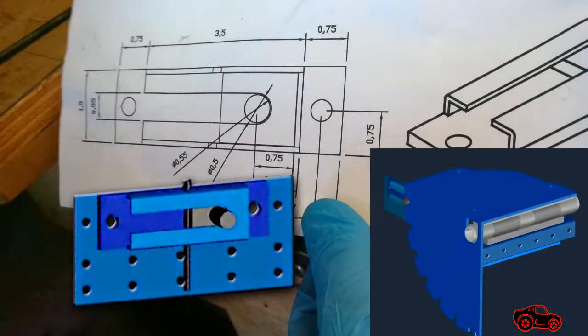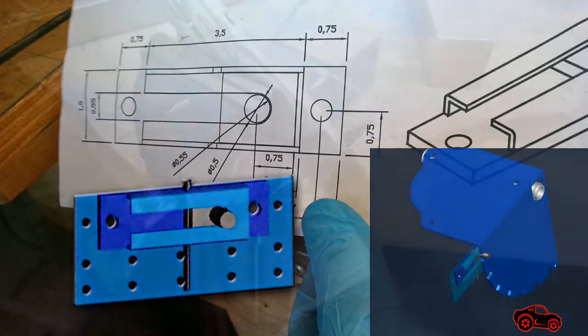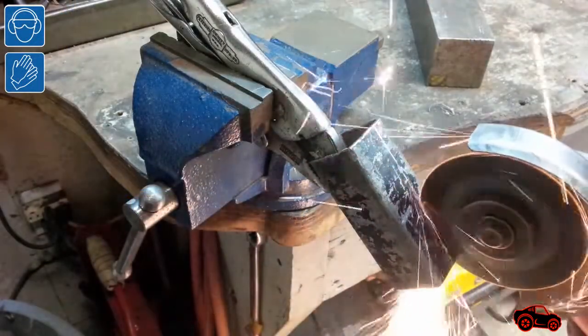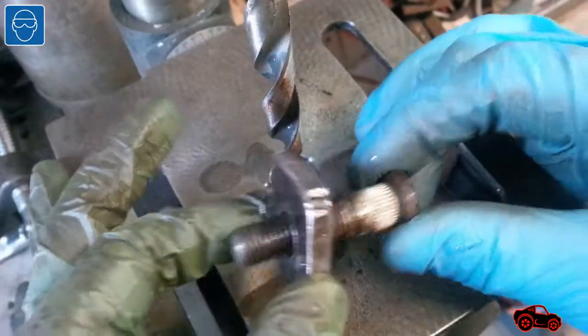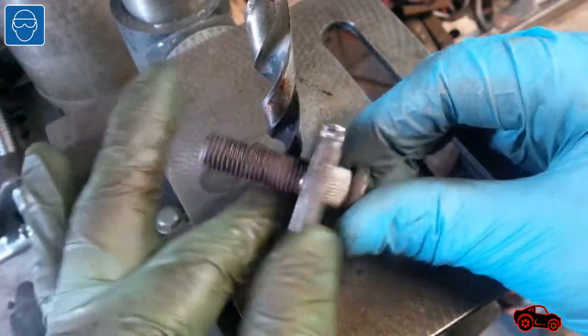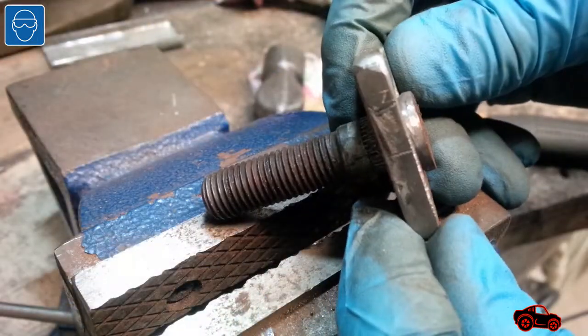To hold the side plate in the preset positions, I designed a strong locking system. I used a section of square tube, steel plates, and a wheel stud as basic components. To be able to have the slots ending flush with the back of the sliding plate, I modified the parts as shown. Then I removed the metal sticking out.